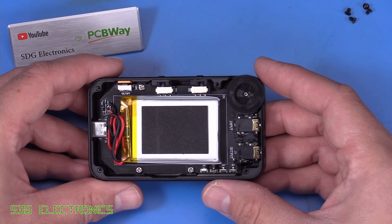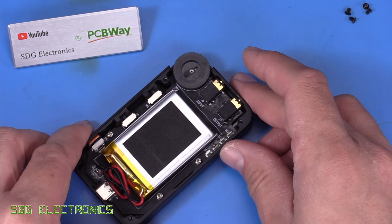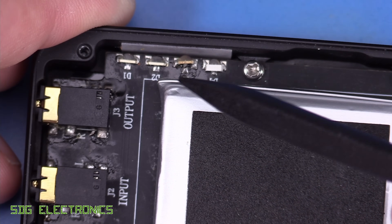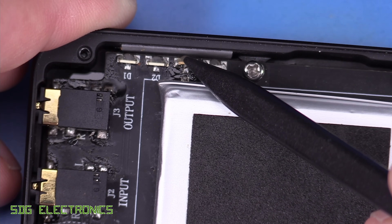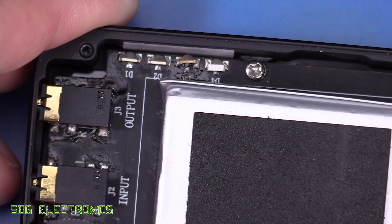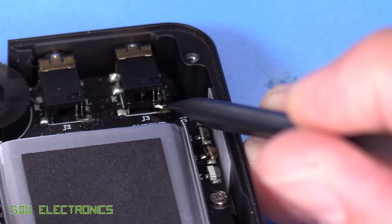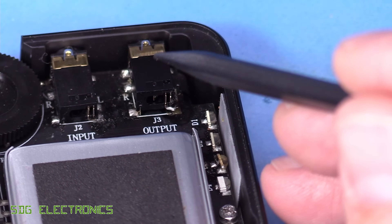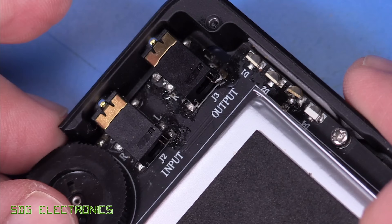We've got some screws on the bottom — let's take the cover off and have a look inside. Most of the components are on the other side. I'm not sure if this is factory soldering or whether someone's already been in here — I think it's factory but it's pretty poor. You can see the LED that was the brightest is right up against the diffuser, heavily discoloured, and looks like it's been reworked quite badly. The main problem is the headphone jack is lifted off the board and the pad has been lifted with it. I think this was probably dropped while headphones were plugged in and it ripped the connector off the board.